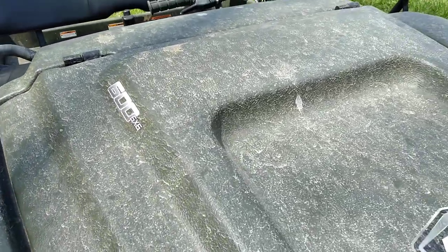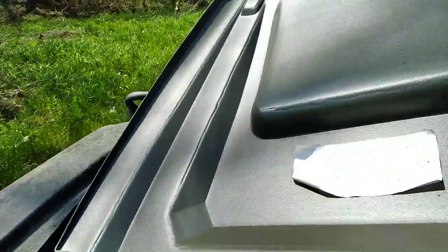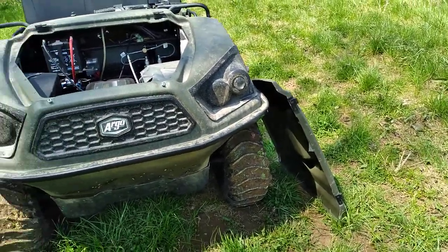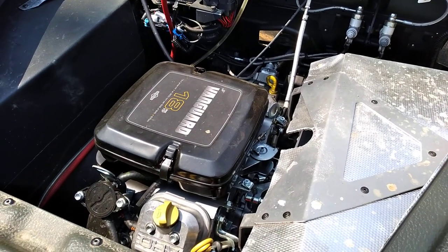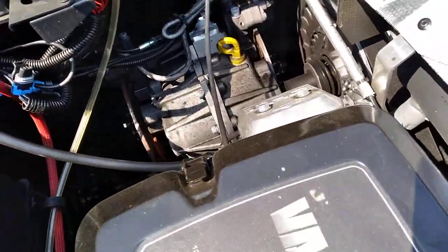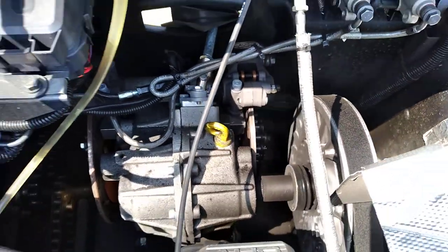This is the Argo 6x6. We're gonna pop the hood — you can raise the hood up like that and it'll set up there, or if you slide it toward the driver's side you can take the hood off altogether, no tools required. This does have the Vanguard 18 horsepower, carbureted, air-cooled, four-stroke motor. You can see the machine is belt driven — there is a belt — and it is also chain driven. There are three chains on that side and three chains on this side, so you have one belt and six chains.